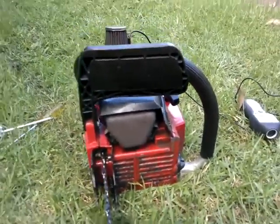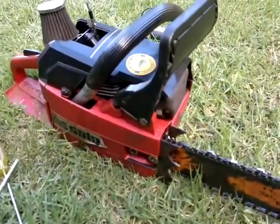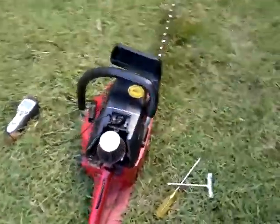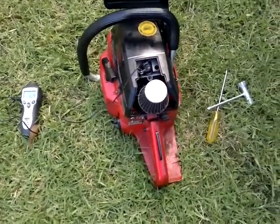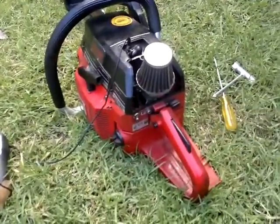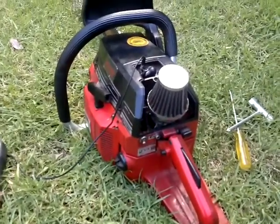Put a two-foot bar on, but just as I was about to do it the oil pump packed it in, so had to rush home and get another one together. Haven't cut anything yet — brand new chain. I'm going to keep it below 14,000 revs; it's designed for 12,500 but just below 14,000 shouldn't do any damage to the motor. Sounds good, I'm happy — keep you tuned.